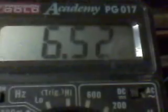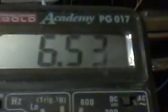So there's two separate channels now. So what we're seeing on the input current to the boost step up, this is set to 12 volts actually. It's set to about 12 volts on the output to the supercapacitors to charge them up. I'm seeing one LED is coming on. The actual current is only about 23 milliamps, right? The voltage on the supercapacitors at the moment is 6.52 volts. It's slowly climbing. Actually, it's climbing a lot faster than it did before because of the better voltages.